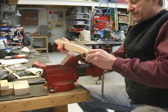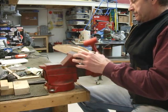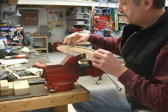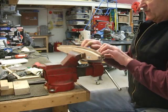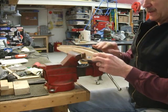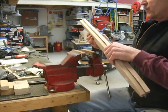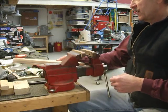When I get to this point, I'm going to start at the tip and then start moving forward. The reason I started at the tip is because this rolls over a lot in this area — obviously where the maximum amount of curve is in the airfoil shape. I want to make sure it doesn't keep stretching all the way to the end and really making a bow. So I started on this side and worked my way towards the middle. That way, anything that gets stretched can be gathered back in the middle of the shape of the rib.